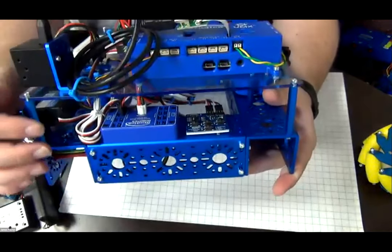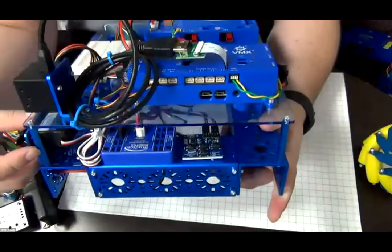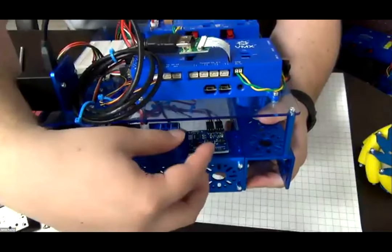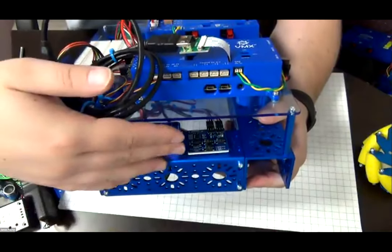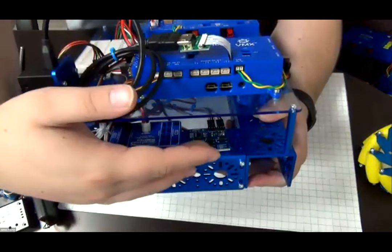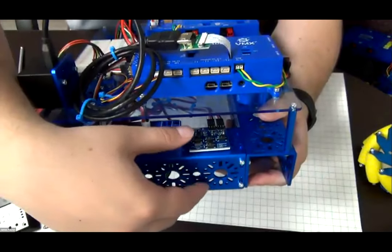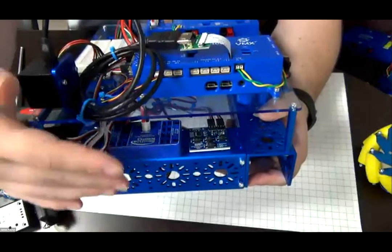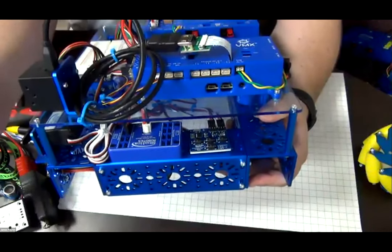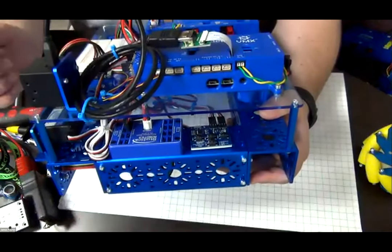Right now the servo is configured in standard mode. If I wanted to change it to continuous mode, I would then have to use the programmer. You don't have to put the programmer on your robot. The reason why it's here is that we always have a programmer for the training platform in order to change it to a continuous or standard servo rotation, so that we don't need to show it outside or forget it for training. It's always there.